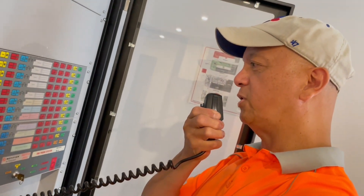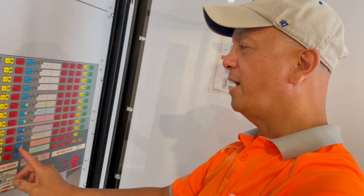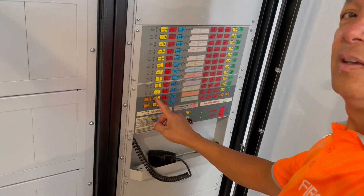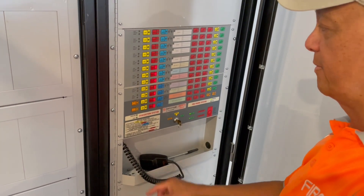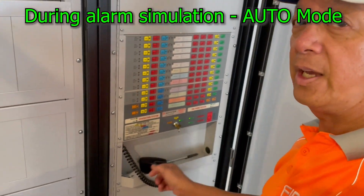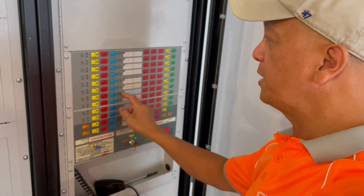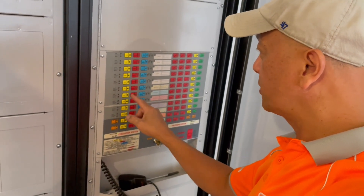Making a test — you see the microphone: 'Your attention please, this is a test, please disregard all emergency warnings, this is a test only.' Then I activate all alert, then evacuation. When doing a test, make sure you initiate the announcement first and then activate an alarm from the fire panel, making sure the alarm goes through the FIP signal.